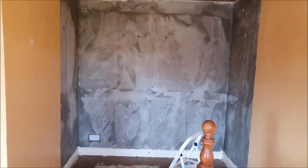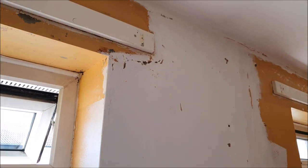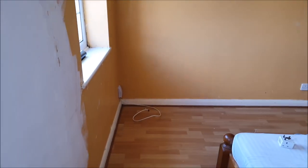That's how easy it is, guys and girls. I'm not going to bore you while I keep doing it. It's now about 10 past 10am - starting time was approximately 5 past 8 this morning. As you can see, all the room's top paper and lining paper is all stripped. These two rooms I'm doing at the same time, so the next room is pretty much identical. We'll give this room a chance to dry out and then I'll go through all the next jobs and procedures on the next phase.